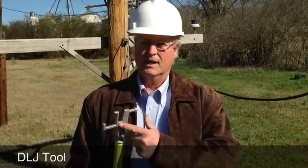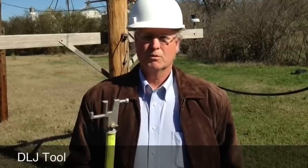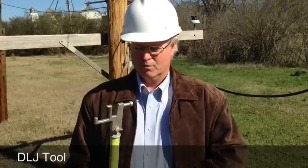You can also set limbs in here. If you're getting your conductors up on snow storms or ice storms, you can put it in the bottom part of this little V here, twist them and break them off at the point, clear your conductors and restore power faster. It's a win for the linemen, a win for the power companies, and a win for the customers.